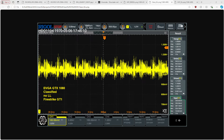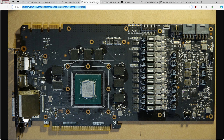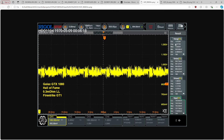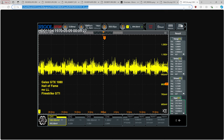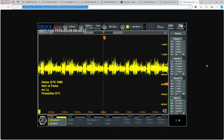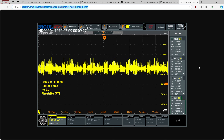At this point I might just pull in some pictures of the classified PCB as well — this is going way past what I originally planned for this video, but too late. Hall of Fame with no V-Droop: average voltage much closer to the classified now — 1.046 versus 1.05. That's only 4 millivolts lower, so we can basically compare minimum versus minimum directly. Worst-case undershoot on the classified was 905 millivolts. Worst-case undershoot on the Hall of Fame was 921 millivolts — about 15 millivolts better undershoot performance.